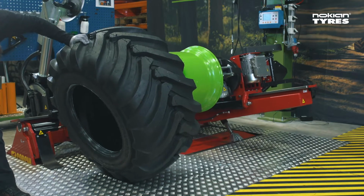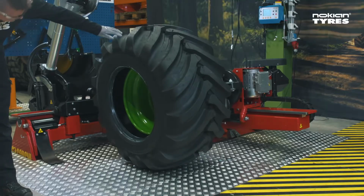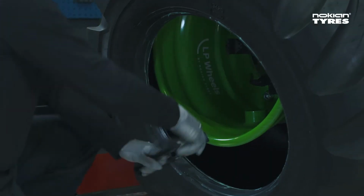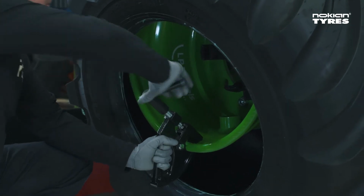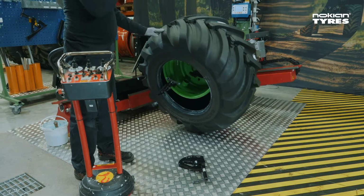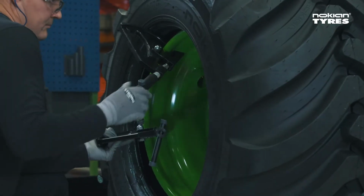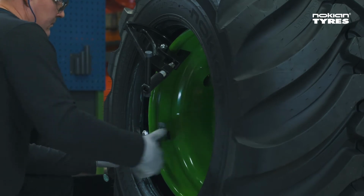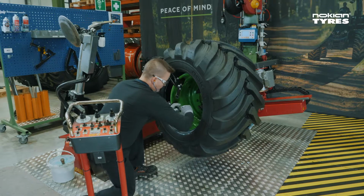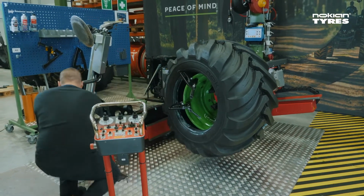Drive the first flange of the rim inside the tyre. Press the tyre gently and rotate the rim. First, attach a small mounting clamp to the rim flange right from the valve hole. Make sure to tighten it properly. Rotate the rim about 90 degrees and attach the bigger mounting clamp developed by Nokian tyres. The correct distance between these two clamps equals the distance between 4 lugs. Make sure to tighten the second clamp properly as well.